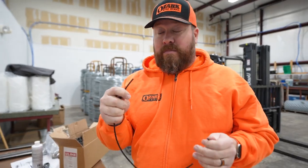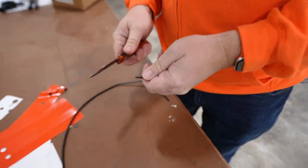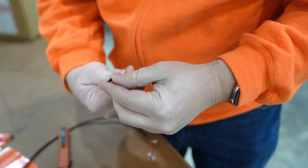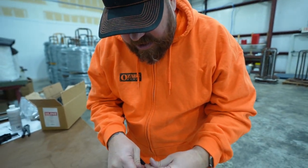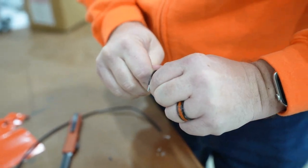So what we have here is a piece of extruded and bonded wire — black coated, 11-gauge core, 8-gauge finish to be specific. The other is just regular extruded wire that we had picked up from a national wholesaler. So say this wire gets nicked for whatever reason — weed eater, whatever — this coating peels right off. There's nothing bonding this coating to this wire. So if you get a break in the twist or any sort of scuff, it'll peel right off.